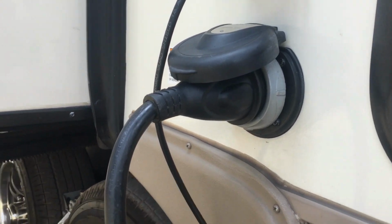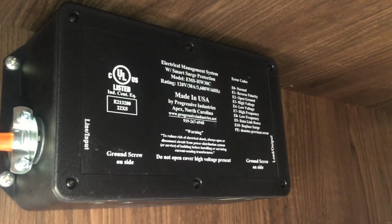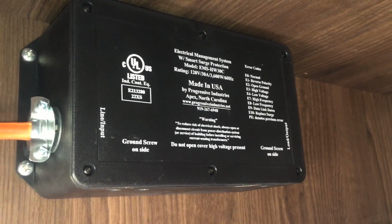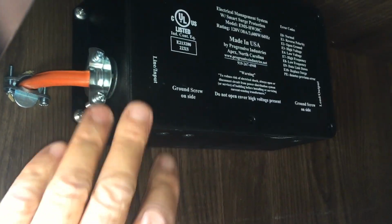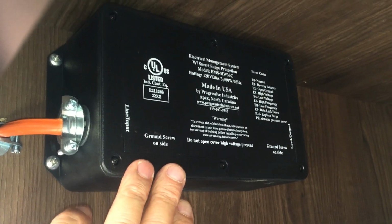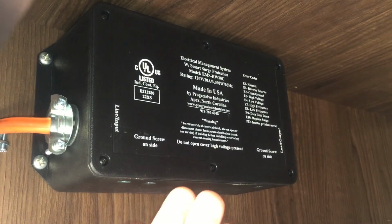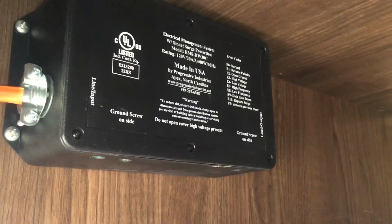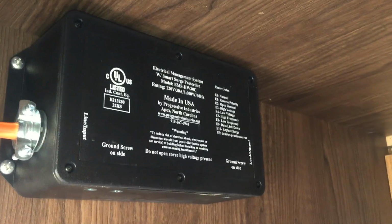Before we go inside, I want to show you, here's where the power comes into the trailer. I have it wired up into here, and I'll put a link in the description below of when I installed this unit, the Progressive Industries Smart Surge Protection System. And so what happens with this, if I get a low voltage or high voltage, this will kick out to protect our system, and then when the voltage is correct again, it will kick back on. So it automatically kicks on and off for voltage, high and low. And then there's a wire that goes off of this and goes into my monitor inside, which I'll show you right now.